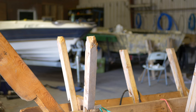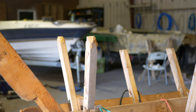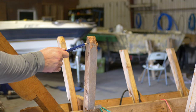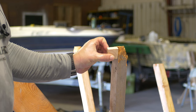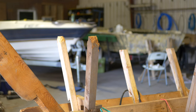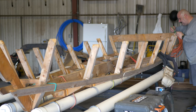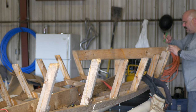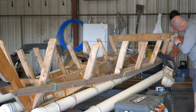While this thing was under the tarp in the backyard, the dogs decided they were going to chew on my panga, which has caused me a large amount of distress. Fortunately, most of these spots are going to be cut out of the boards to make way for the shear clamp, which is a 1x2. So I'm going to go around, notch these out, mark them off, and get ready to cut each piece. Everything's still stout and solid — the wood looks a little aged, but it's going to be all right.